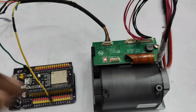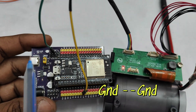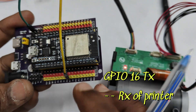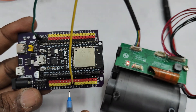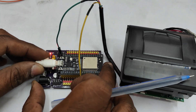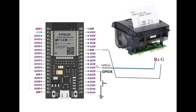We will be using only two wires from the printer: the RX pin and the ground. RX goes to TX of the ESP32, and ground to ground. The TX of the ESP32 is GPIO 16 — since there are multiple UARTs in the ESP32, we use Serial2, which is GPIO 16 as the TX pin. It goes to RX of the printer, and ground to ground. Power the ESP32 using a USB cable from the PC for code upload, and a separate 12 volt 2 ampere power source is required for the printer.